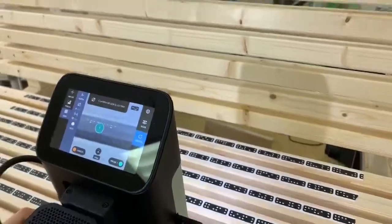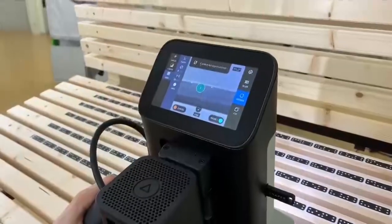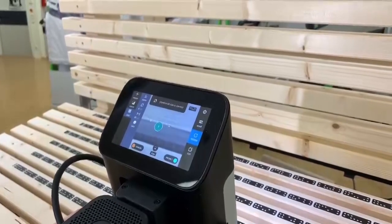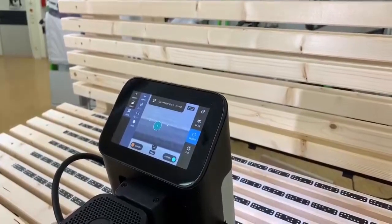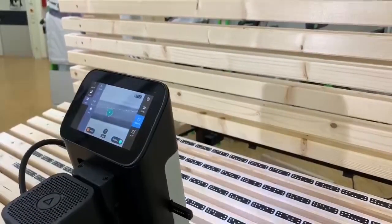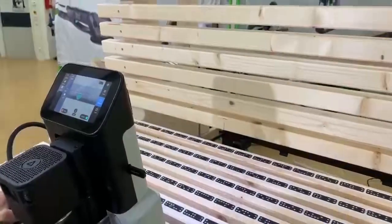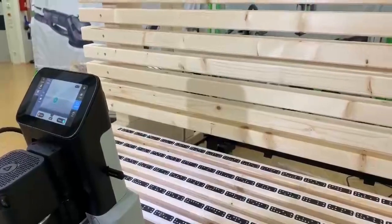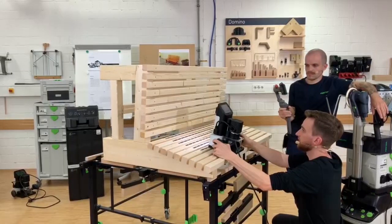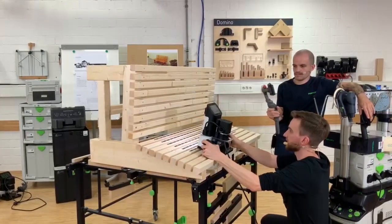Okay, so I'm probing, right? I guess you're right. It's the, how we call it, chamfer, I think. Yeah. Chamfer. Okay, and I'm going to probe once. So I have 1 point. Now I'm moving for a second probe. So just move somewhere, a bit. If you define 2 points in a space, you will define a line. So I'm probing the second point right here.